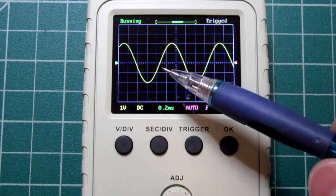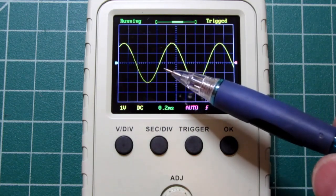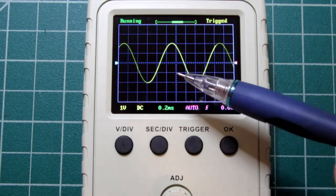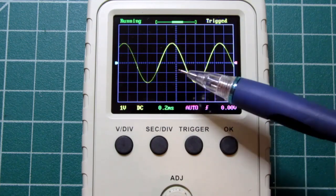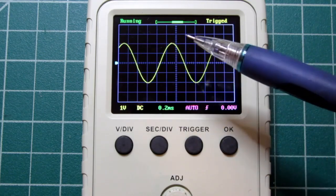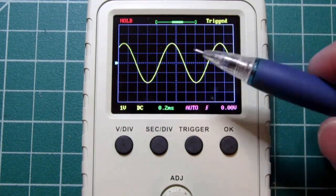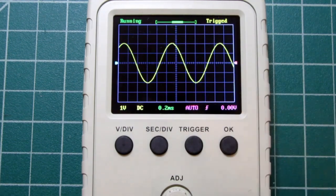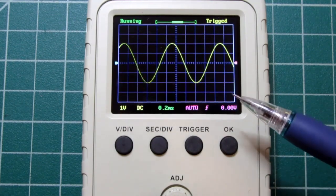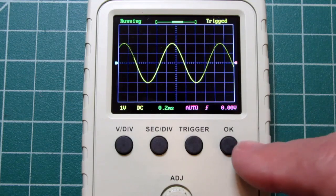It's useful to be able to toggle hold mode on and off because there's always just a little bit of jitter with the waveform. The time base on this is not absolutely rock solid, and you can get a little bit of horizontal jiggliness. It's more noticeable as you go to faster scans or higher frequency signals, and sometimes it's nice to just hold it and avoid that jitter — it just stabilizes it. The scope will also put itself in hold for various operations, but that can still be overridden by pushing the OK button.